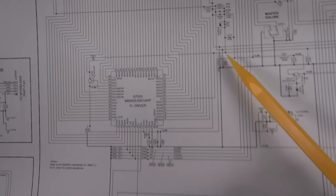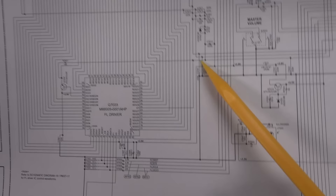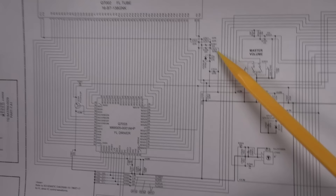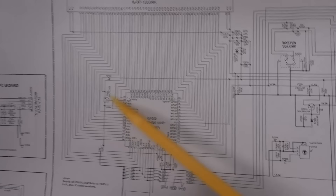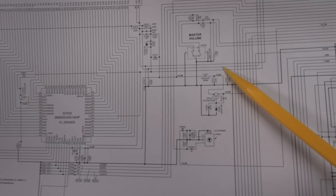I'm going to check those caps. That 47 µF across the diode looks okay. And the other cap in there — that 10 µF — that's just fine as well. So what the problem is, is this VP voltage here. It's supposed to be, like, significantly negative — i.e. tens of volts negative. Like, minus 40 volts or something — it's the pull-down voltage for the vacuum fluorescent tube. And we're only getting positive 2 volts on there. That's all we're measuring. Everything else around here seems to be fine. So I can only assume — it's going in there, that's 10K, that's high impedance, so it's nothing to do with that transistor there. The VP does go over to here. There is a cap there — could that one be shorted? I might have to check that. But it does go somewhere over to the connector.